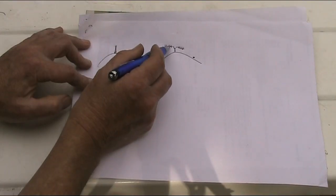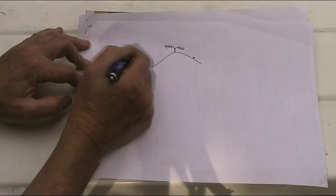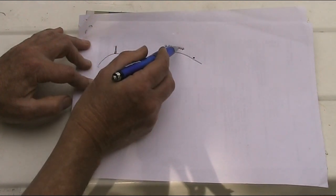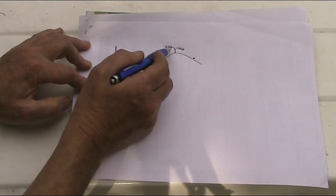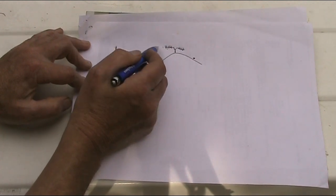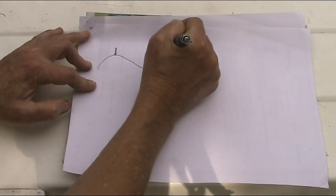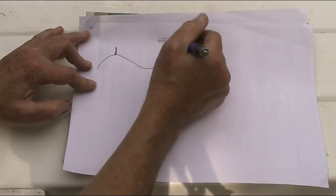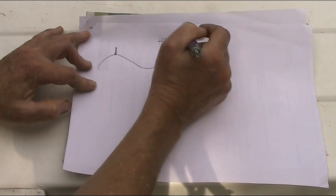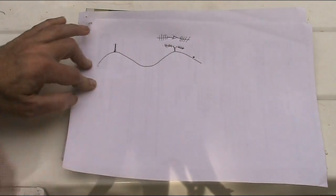Some people put these up in the bush on a hill where you could be pointing towards the main TV station and then a second antenna pointing towards you, and that apparently improved reception. If you are only interested in reception, then there's the potential to put an amplifier, maybe a masthead amplifier, maybe a booster, I don't know. I haven't actually tried this, but that could provide a bit of extra gain, or at least overcome the loss in the feed line.